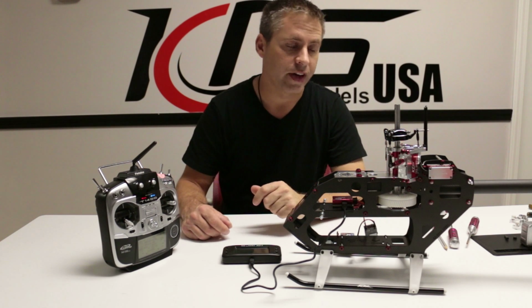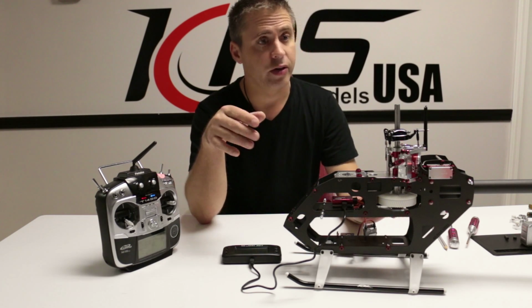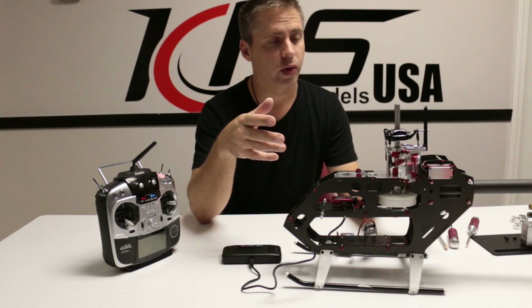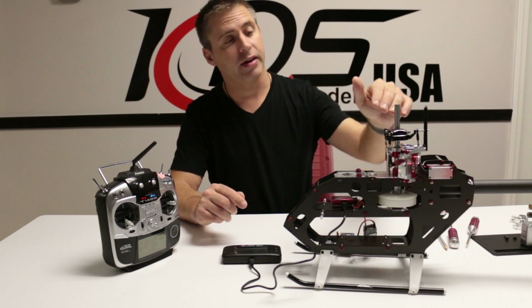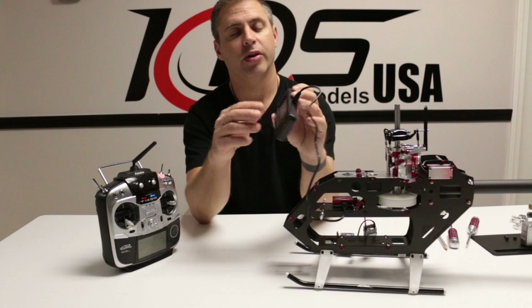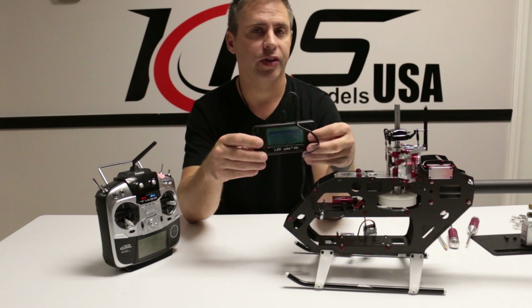Now, if it's not moving correctly, generally there's a longer video you can reference, but I would normally look to see how many servos are moving wrong, if it's one or two. I start by reversing them in my transmitter, aileron, elevator. If it's an exact reverse, if you need to do one or the other, you can go into the servo menu here, which is line 3. So you just scroll down to the servo menu,